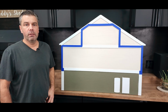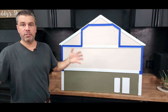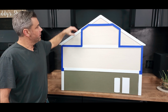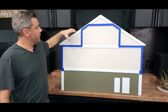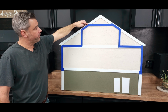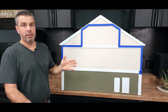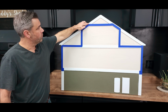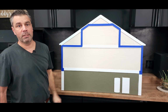Okay, so there is another way to vent this project here without using 2 gable end vents on either side of the building. So let's say you didn't want to see the gable end vents, you want to make it kind of hidden. You really can do that unless you plan on filling this with a solid barrier. So you're going to need air travel from one area up to the other, in which case that would involve either fiberglass and baffles in this space here, or I've seen guys take wooden strips and then wooden baffle it and then spray foam against the wooden baffle. But either way, you would need a cold roof option here in order to transfer your heat flow from here to the upper and then ultimately to the exterior.